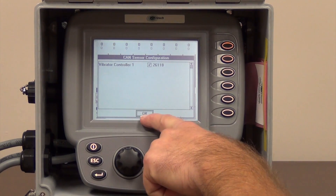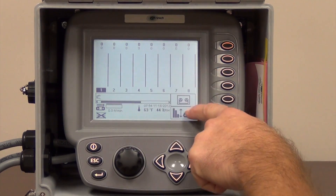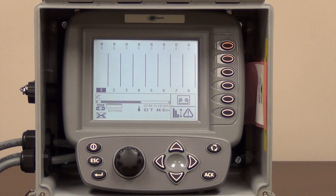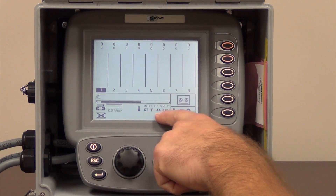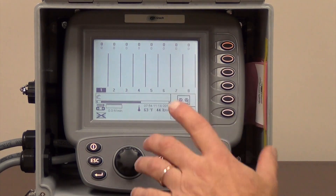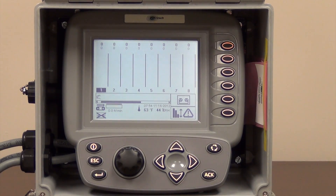We have to come down and highlight our OK box to accept the changes that we just made. It found a controller because now you can see where all this area right here is highlighted nice and black, which is a good functional part of the system. On this system we also have the temperature and relative humidity sensor, and the speed wheel down here in the lower left hand corner, and it found all those controllers also, which is a good sign. So we need to save this back to memory also — so that at the end of the day when we take this monitor off our paver and come back the next morning, all we have to do is plug it into our power and communication lines and it will find all the information stored for your next day of paving.